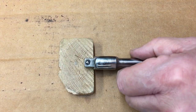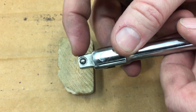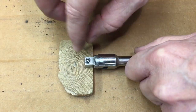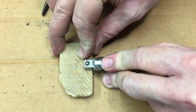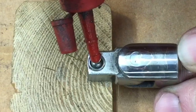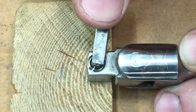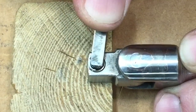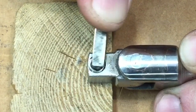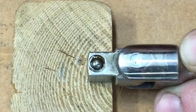To keep your ball detent in good operating condition, especially if it's frozen, you want to use a penetrating oil. But this one seems to be fine, so we're going to place it on a block of wood for support. I'm going to use regular 3-in-1 oil and put a drop right on top of it. Then taking a flat blade screwdriver, just press down until the oil is absorbed — see how it goes down. Just back and forth a couple of times, then wipe it off with a piece of paper towel, and that'll keep it nice and oiled up.